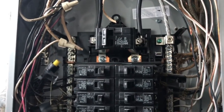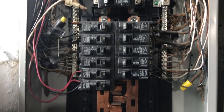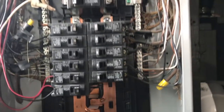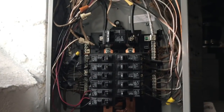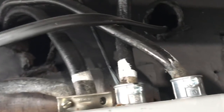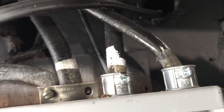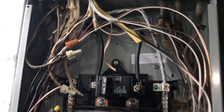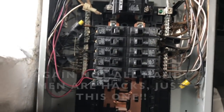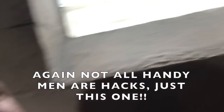This is what pisses me off - these people bought this house and the hacks have been in here. This could have been a bargaining tool for them. Take off the panel cover and see what you're up against - just how sloppy it is. My panels are neat and beautiful when I'm done. But this thing - the connectors are wrong, those are for EMT pipe only. That one doesn't even have a screw in it. The service entrance cable doesn't even have a connector on it.